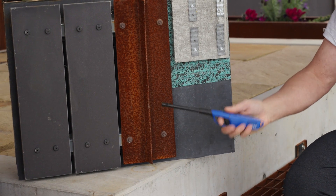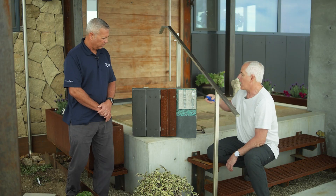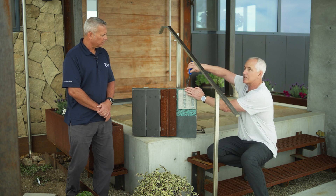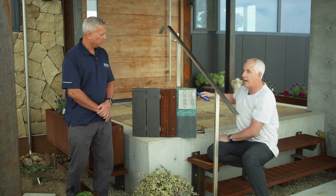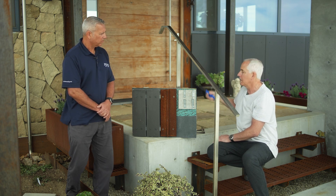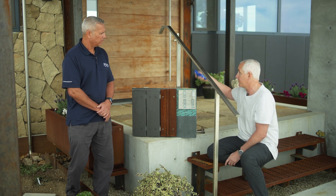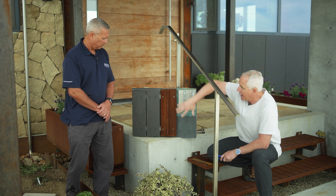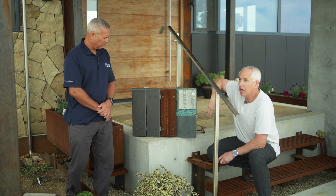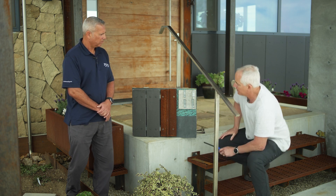The same thing with the metal — I can put the flame on here, I can put it on the gypsum board. Gypsum board is not going to burn. Metal framing isn't going to burn. I have spray foam insulation — that's not flammable either. The whole idea was to have a shell on the outside of the house where nothing is flammable. Zero fire propagating rating.